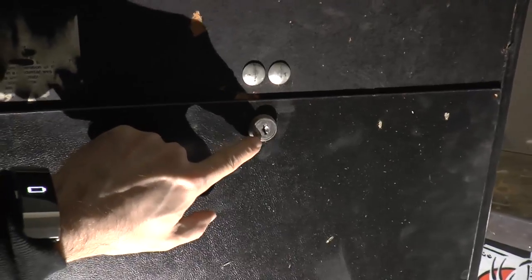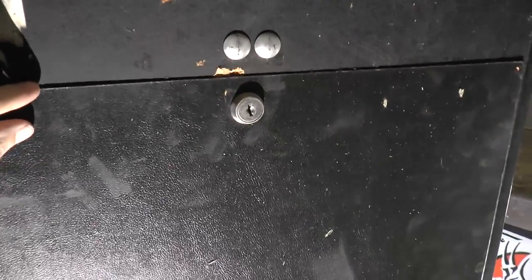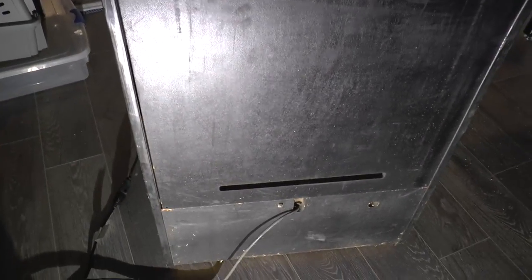There appears to be a lock here, but there was no lock on the other side, so I could probably pick that. There's the switch and the cord. I'm a little reluctant to just plug it in immediately, because with older machines the capacitors can just sort of explode. So it's possible that what I'll do is just take a look inside, take a look at the state of the power supply, maybe plug it in without it being plugged into the actual electronics, and see what happens.